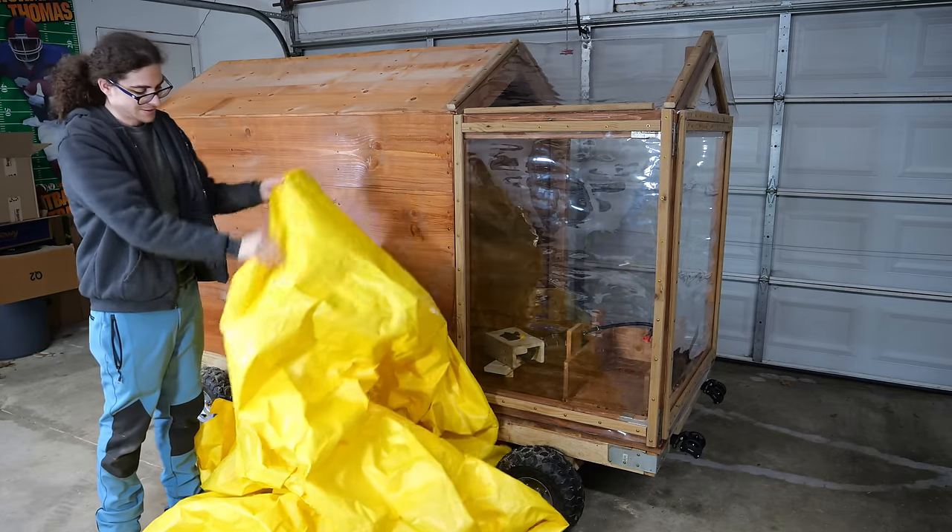Onto the back door. Our door is on there, but it's not much of a door right now other than I can open and close it. I really want a handle for this thing — it's a stainless steel handle and it has a lock and key. I've never drilled some holes for a door handle before, so I ended up buying this little jig that you slide on the door. But since my door was a little too thick, I ended up kind of breaking it and having to use some wood clamps to hold it in place — this just holds it nice and steady so that you can drill some holes for the handle. Since my door is a little too thick, I kind of have to just line up the hole and go by feel. I then took my oscillating tool to cut out a little section for the little locking bit. This part would definitely be easier if I had a nice set of chisels, but I don't, so I'm just using this and I think it turned out fine.